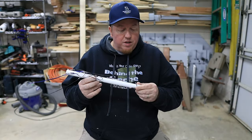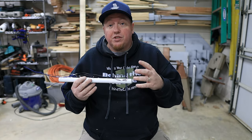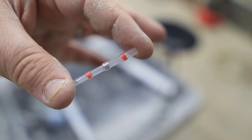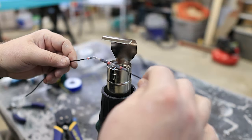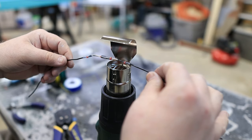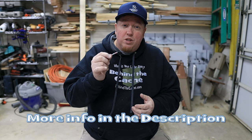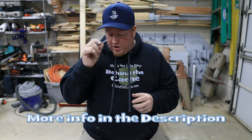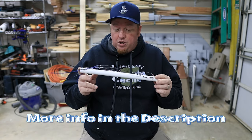Now before I get to that, I wanted to tell you the soldering I did on this is a little bit different. I actually got what are called solder sleeves. It's very simple, it has the solder in the middle and then it's got the shrink wrap on the outside. You take your heat gun and heat it up, and it shrinks the shrink wrap and melts the solder in there to make that seal. So if you don't really know how to solder very well, this is a really great option, and I have a link to these down in the description. I wanted to use these today because this was going to be tedious and I thought this would be a great way of doing it.